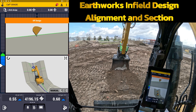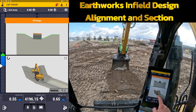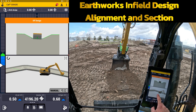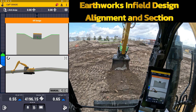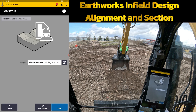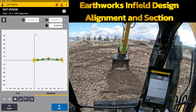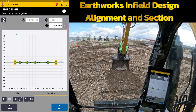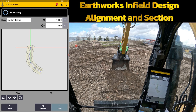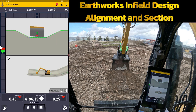Now I have the alignment and the V-ditch that we made. You can see in cross section that it's coming up pretty high behind me — that's the high point I created to demonstrate. If you never want that, you can go edit it. I don't have to rebuild the entire thing — I go to the shovel and gear, job setup, back into the black box, and where V-ditch is I have three buttons and I can edit. In edit I go to elevation, change and tweak that right now, take that high point out, level it out, hit next — don't change anything else. Everything else stays the same; you're just changing the elevation. That's the beauty of infield design — no design, no problem. Hit apply.